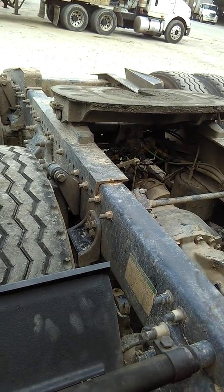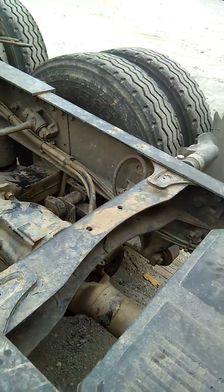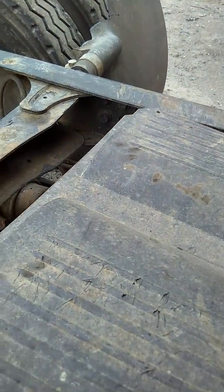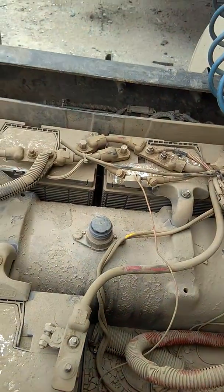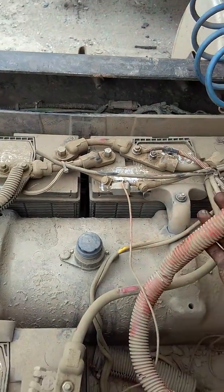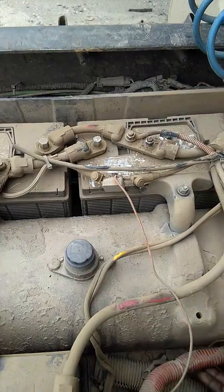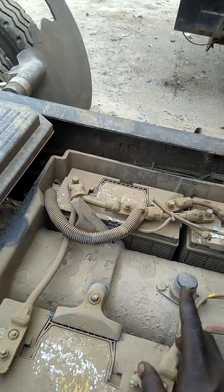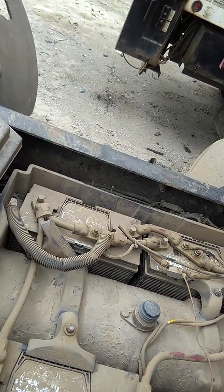Also there'll be a lot more pressure than usual in your overflow. I've done most of the work already but I'm starting in the back of the truck to point out the first thing you want to do whenever you do any kind of maintenance - go ahead and look in your battery section and disconnect your hot lead from your batteries. This goes to all the points in the tractor that need juice. Disconnect that so anything you're doing under the hood won't cause any shorts.